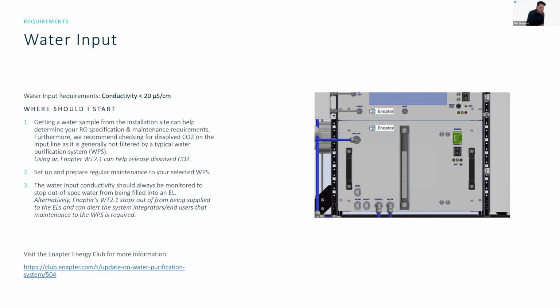Generally, when you are looking at water traps for the hydrogen purge, I think this question was asked by Niels de Smet, a good question again. You have to remember to look at material compatibility and at the pressures that are possible to be created. Each water trap will have a pressure rating, and you don't want to exceed that pressure. In the oxygen vent line, we have atmospheric pressure and just the oxygen environment, which is a lot easier to handle than the intermittent releases from hydrogen inside the purge line.